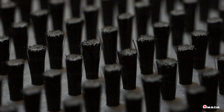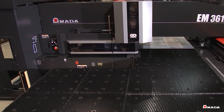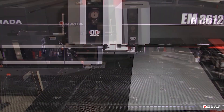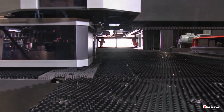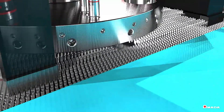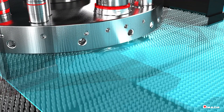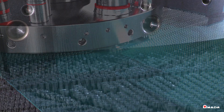The standard brush table also helps reduce noise levels and eliminate scratching on the material. The ZR turret configuration features a lower turret which is recessed under the brush table. As the turret rotates to use a different tool, the corresponding die rises through the window on the brush table.